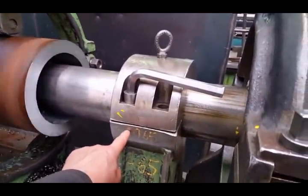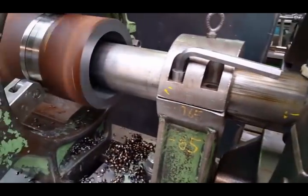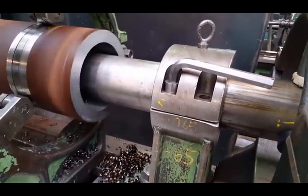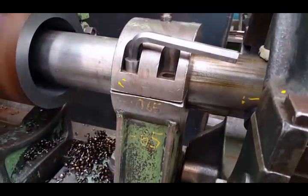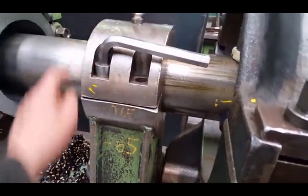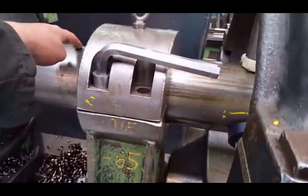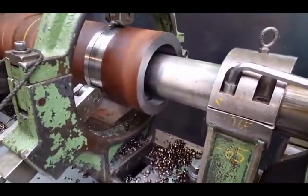Now, if you see this, it's got minus 65 for a reason. When I clock jobs up to it, this is out of line — minus 65 thou, minus 20 thou the other way, zero to the top. I have to clock them to this — what's out of line.